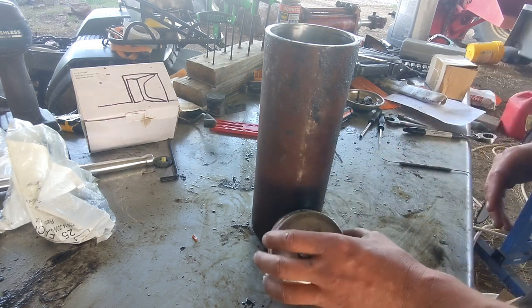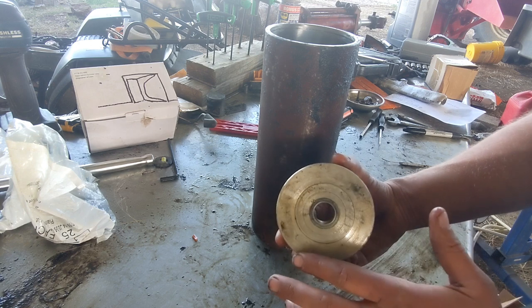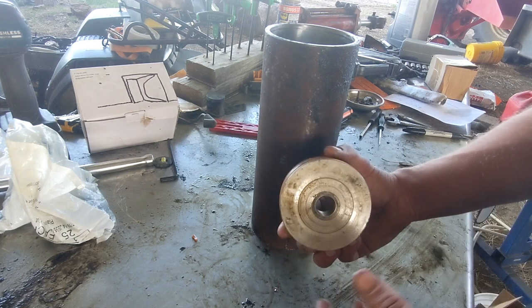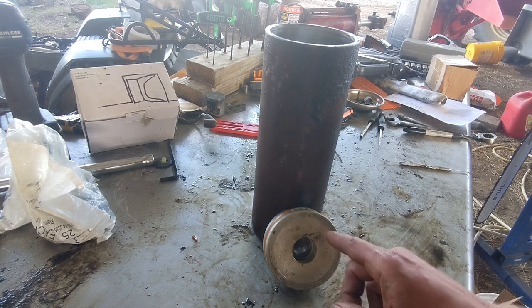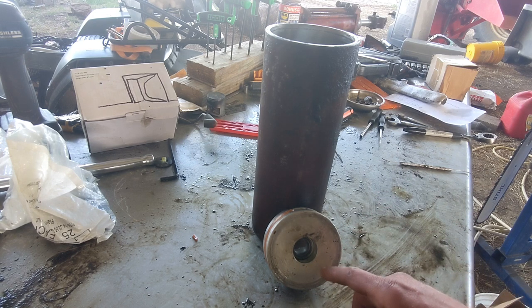The other thing that is just as important but may not be as obvious is the size of the rod. Like I said, you think about the pressure being applied here to this side. You have this entire diameter that pressure is being applied to. There's a nut and stuff on here, but you can still push against that, so it's just this area. That's the entire area. On this side, however, there's a rod in the middle of it, right? And so the area that your pressure can actually push on is what's called the annular area around the rod. Think about a donut, right? Because this space here, pressure can't push against it because there's a rod in the way. Sort of makes sense.